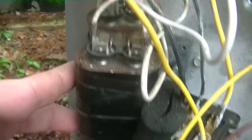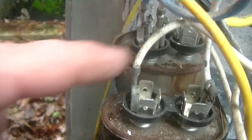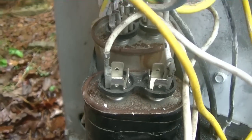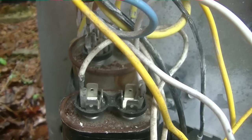Instead of strapping the capacitors, they duct-taped them and then laid a piece of rubber tech right here so it wouldn't touch against the contactor. And instead of going to get the right capacitor, what they're doing is jumping from common to here and then hermetic to here to double the microfarads to pick up the right microfarads for the hermetic side of the capacitor.